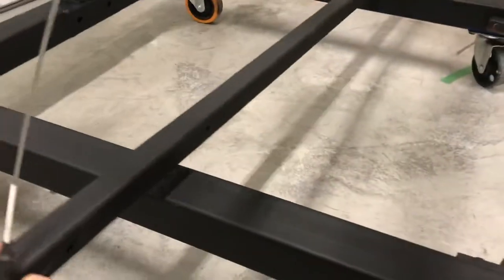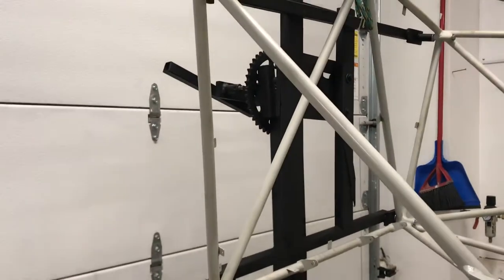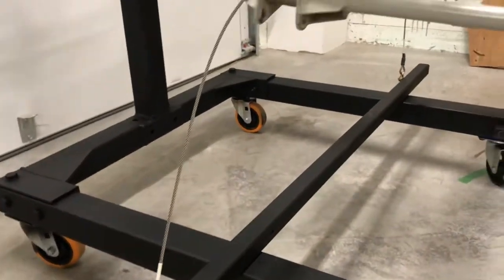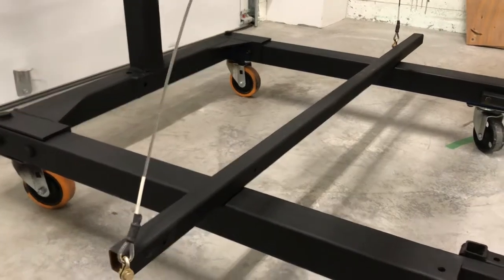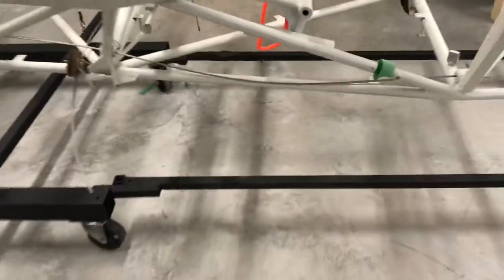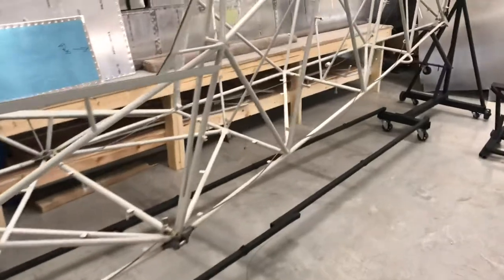Moving to the back here. This bar is just loose in here, but what it does is let me sit the airframe down on the front stand so I can take the firewall adapter plate off and sit it down. With a couple of shims I can get the lower datum sitting nice and level for rigging the tail and get a reference point. You can see these long rails tying the front to the back — not totally necessary, but when we get to the back I'll show you why they're required on this setup.